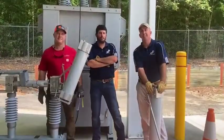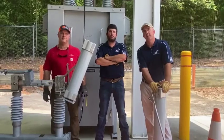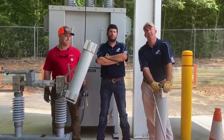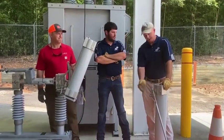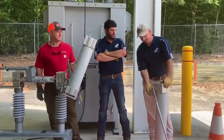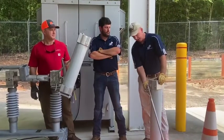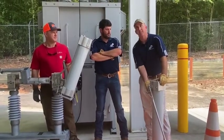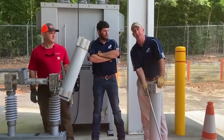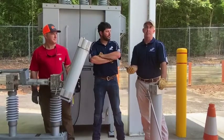Hello, Utility Service Agency here representing Cleveland Price. Old traditional vacuum interrupters in the transmission and substation space fail. Why is that? Because they use either mineral oil or SF6 to insulate the vacuum bottles within the tube. That relies on the seals to last for the lifetime of the interrupter. With positive pressure on the inside, they start to leak — moisture and water get inside, leading to failure.